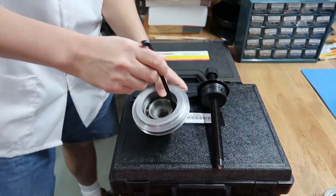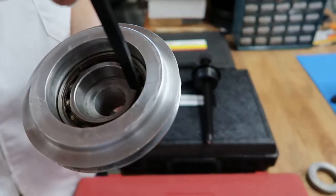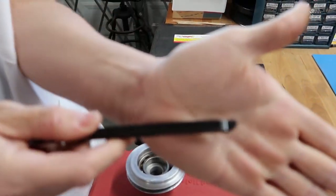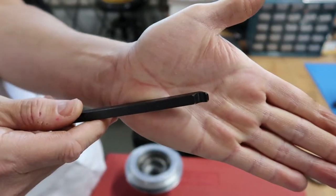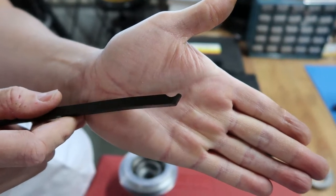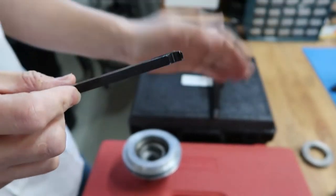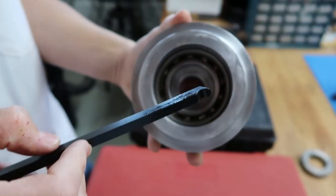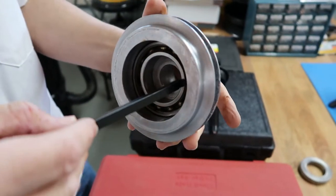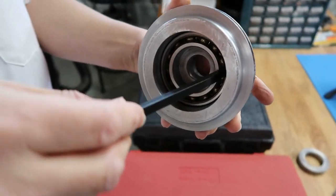Here, bring up one of those arms. Let's get a closer look at the arm, just the arm. Let's get a nice look at the tip of the arm there. Okay, let me know when you're in focus. I'm in pretty good focus there. See that claw? Yeah, I see it. See the chamfers, the claw, very nice. Hold that view right there. See that little notch right there actually inserts outward and holds onto the outer race right there.